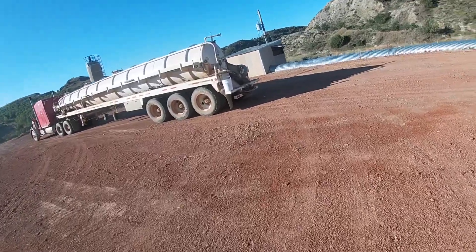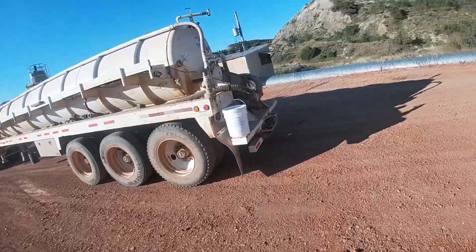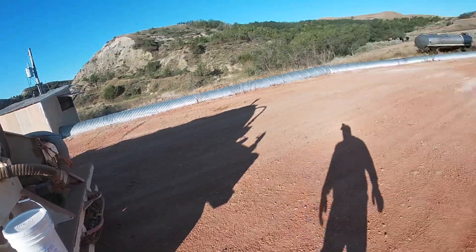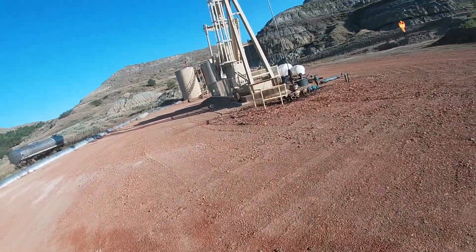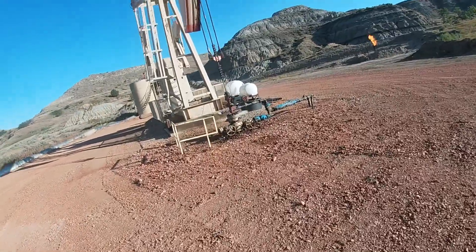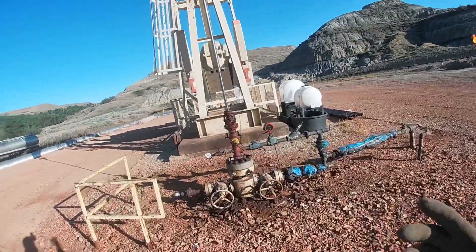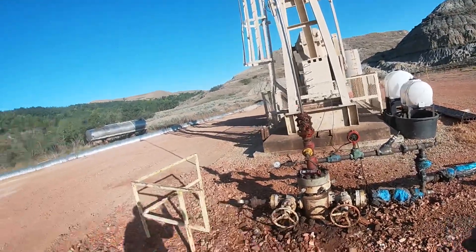That's what we do here on service — a dead drop — where we put this entire bucket of ECO 900 down-hole degreaser and corrosion inhibitor. We'll put the whole five-gallon bucket into a 160-barrel shot and send it down to the bottom, and then we'll put the rest of the fresh water behind it.